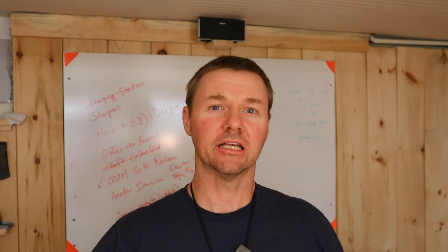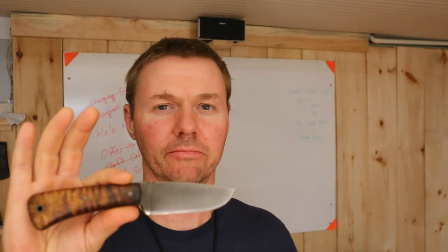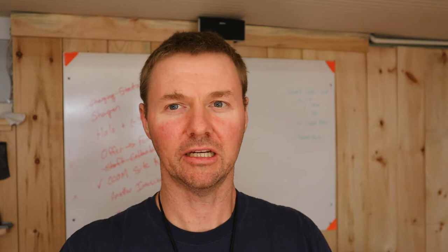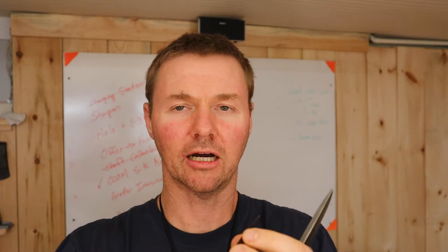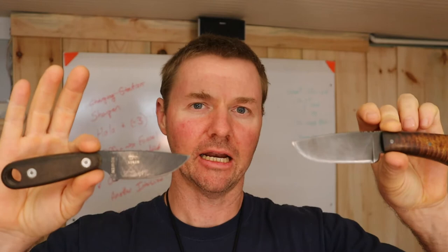This is going to be an edited video again. I got some positive feedback that a minimal amount of editing makes for a better user experience, so I'm going to do that. Because I'm editing, I get to go through the whole process with you and it won't be quite as boring. Ultimately these are not particularly challenging blades to sharpen, but they're exciting because they're really nice, they get used and carried. Nothing fancy — no partial serrations, no tanto tip — but I am going to lightly cut a new bevel, then break out the Edge Pro and take both to a 6,000 grit mirror polish finish.